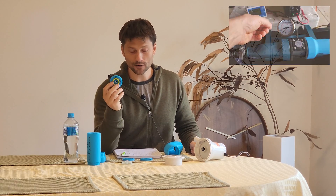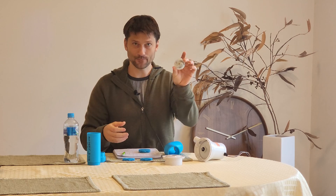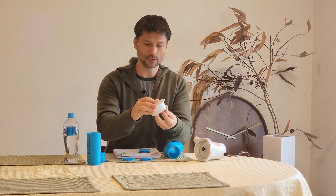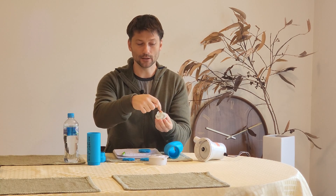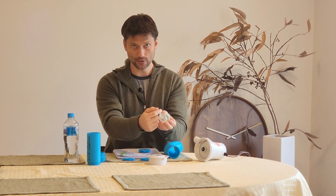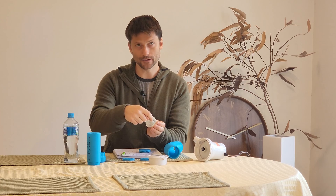In a nutshell of what's going on here: I have a 2,000 gallon per hour Seaflow bilge pump. There's an impeller that spins around in here — this is that impeller, a little nylon three-blade impeller, and it is open-faced. It goes up inside this and sits nice and tight against this edge. Essentially, as tight as possible, because you have a low pressure zone in the middle where it sucks water in, and a high pressure zone on the outside where it's pushing the water out of this hole. However, some of this high pressure water likes to recirculate back along that gap to the low pressure area in the middle.